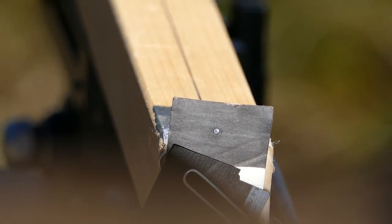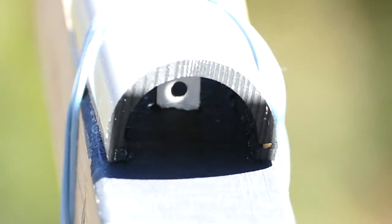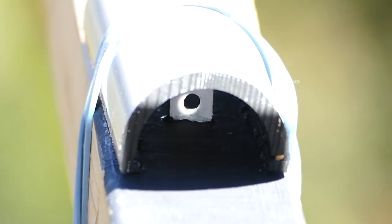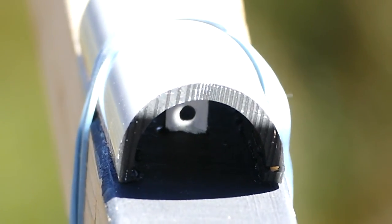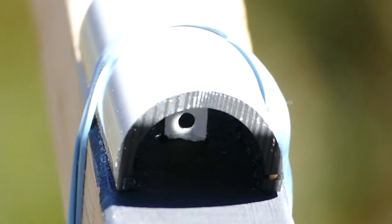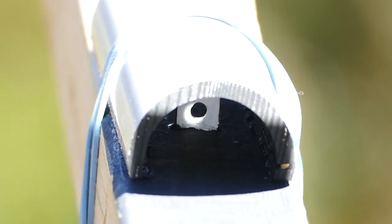By looking through the pinhole at this annulus — that is about a five-hundredths of an inch diameter pinhole — you look through it and use it as a peep sight. You look through the aimer and center that on the peak. Then you line up the beam and get a little needle of light going through the pinhole. You catch it on your hand and walk it until it is centered on there.